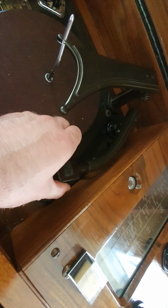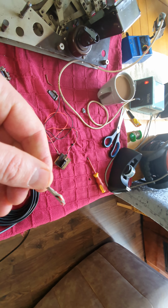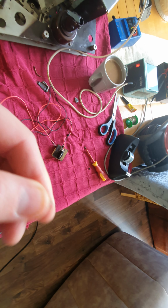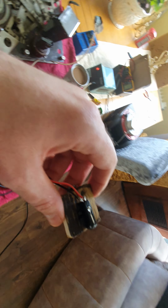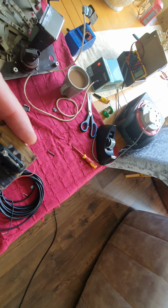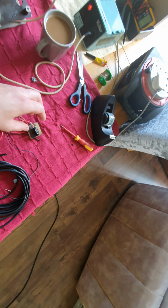The reason I've got it in pieces is because this is unshielded, so it has a hum. So I've managed to get hold of this cable, which has got some shielding on it. You can see around the outside, and it's dual core, so I can use it. So hopefully this will work. So that's all I did, Steve: I put it on the back of the amp, plugged in without doing anything else, and flicked it with my finger. That's got a good output, no problem. If it hums, you've got to shield it, obviously, the best way you can. I'm not an expert in this in any shape or form.